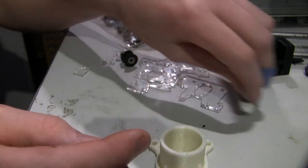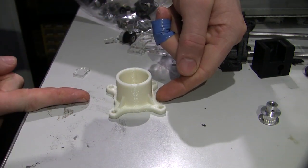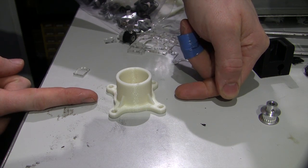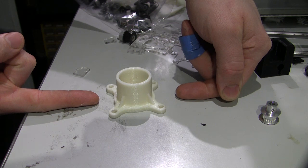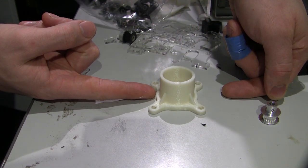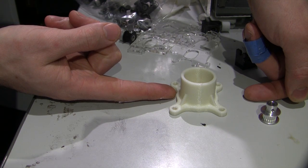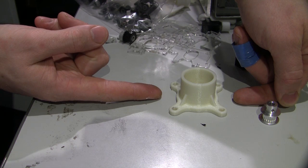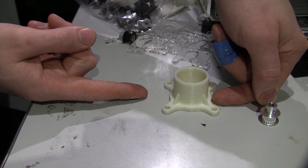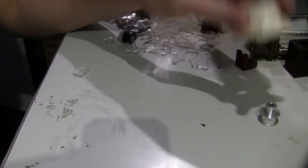And for anyone who doesn't know what backlash is, there's always going to be an amount of slop in something that goes backwards and forwards. Backlash is if I'm pushing this way and then that way, on a pulley or a tooth in the pulley or whatever, something that would have backlash. Every forward movement that I push will be what I tell it. If I say a centimetre, I'll do a centimetre. Now if I say to go in the opposite direction a centimetre, I'll go a centimetre. And then of course I haven't even moved the object yet, but I have moved a centimetre. So it's not until I contact the part that I'll actually start moving it accurately, and that slop is what's called backlash. So you want that to be minimum, as little as possible.